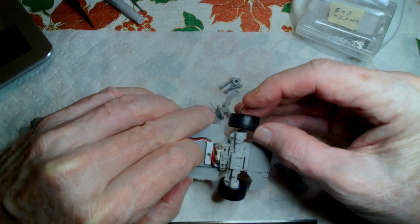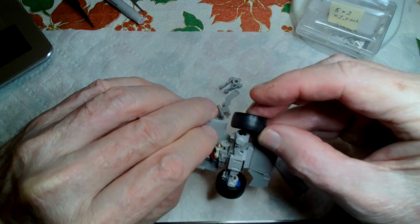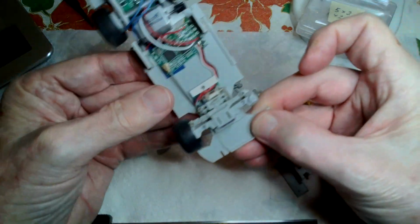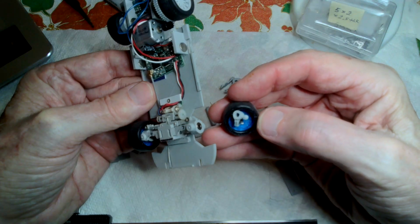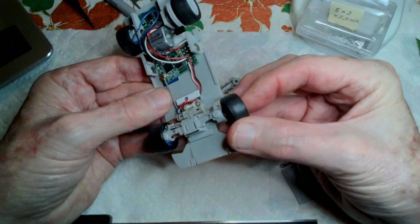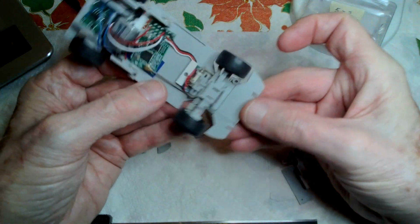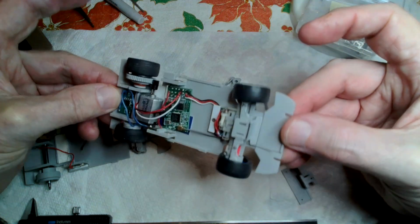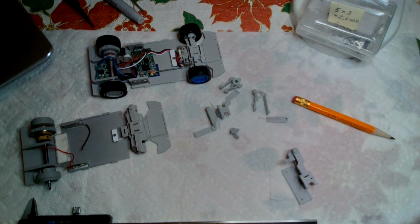For the actual bearings I'm using now, 1 millimeter is about 39 thousandths of an inch, and there's a drill bit that is so close to that. There's an English size drill. You don't even need a metric size drill, and it fits adequately into the 3 by 1 millimeter bearing that I'm currently using. Okay, I think that's all I have to say on the front suspension. I hope that's enough that if somebody wants to design one, I'm hoping that somebody will find a way to improve on what I've done.